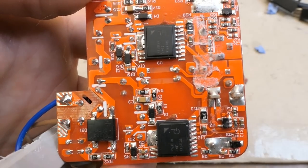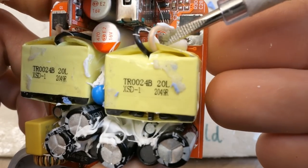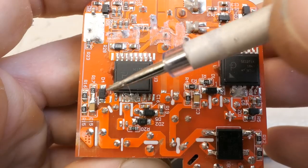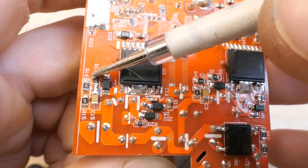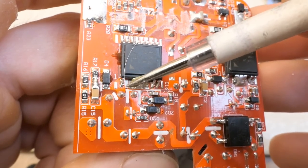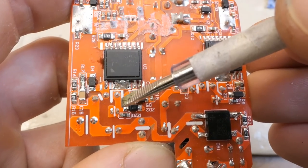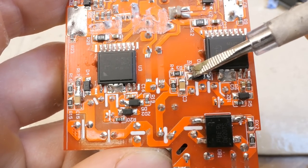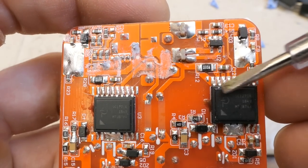The transformers seem typical: they have a primary winding, an auxiliary winding, and a secondary winding which is not on pins but on wires - probably using safety triple-insulated wire for the secondary end. There are snubber networks: from the hot end of the primary it goes via a diode and a low-value resistor into a capacitor with parallel resistors, to clamp and dissipate voltage overshoots when the transistor turns off. There is also a diode rectifying the auxiliary winding to produce a low voltage for the control circuitry. The other transformer has the same - a snubber network and the auxiliary rectification diode.